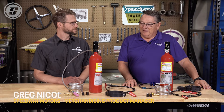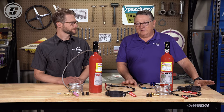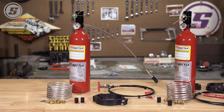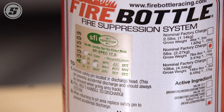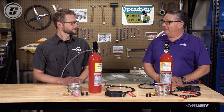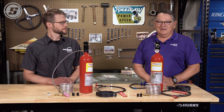As of January 23, if you run with the World of Outlaws, the All Stars, Knoxville, or many other tracks, they're going to require you to have an onboard fire system for the first time. There are three or four systems that are approved. You have to have an SFI certified 17.3 — that is the only rule requirement. You can put the bottle anywhere in the car you want, in any position you want, but you have to have an onboard system.